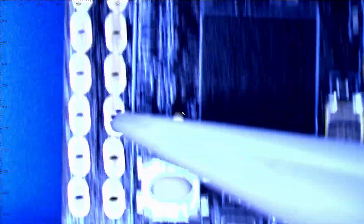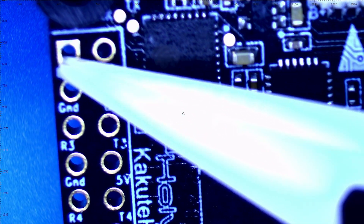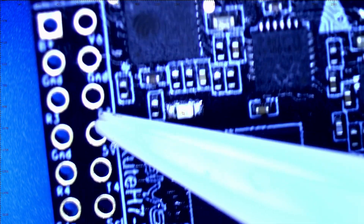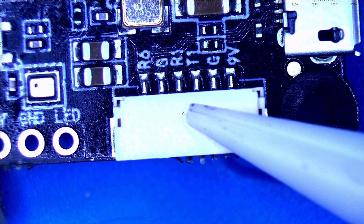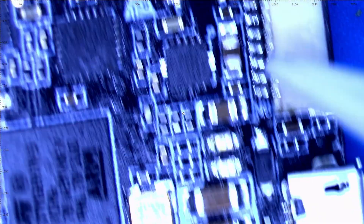This is a big chunk of your pads. You've got battery voltage, video out, two ground pads, R3 and T3 as a spare UART or for your VTX - it can also correlate with DJI since DJI MSP runs off UART1. If you're running the DJI radio, that's what that'll be for. Keep in mind it does come with a plug - you can simply plug in your DJI here. With DJI goggles and DJI radio you don't have to solder anything except your motors. Plug in your ESC, plug in your air unit, solder your motors, and go fly.